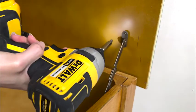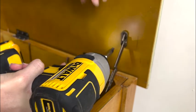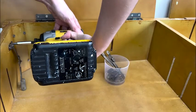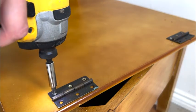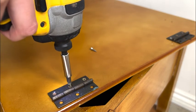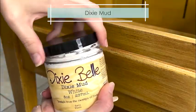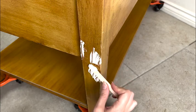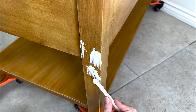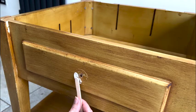I chose to remove the lids from the base of the table so that I wouldn't have to carefully paint around all the hinges and could just paint it quickly and easily. The downside is that I could only paint one side of the lid at a time — it was a case of which is the lesser of two evils: carefully painting around the hinges or getting a perfect finish over a slightly longer time. I used some Dixie Mud as a wood filler to fill in those minor dents around the table and also the tops of the holes left in the storage compartment, since I would be covering them over.